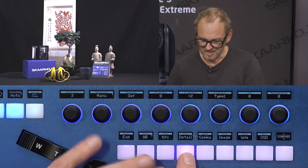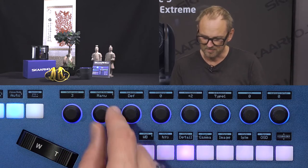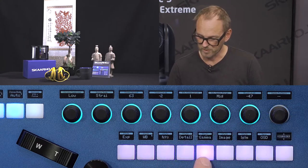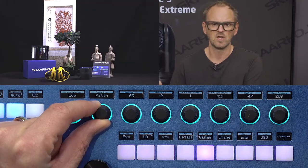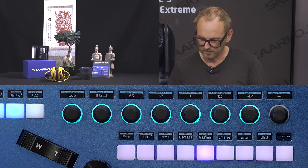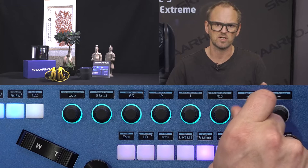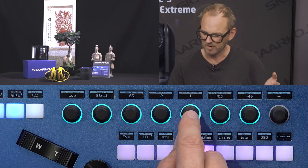In the details menu, there are many sharpness-related settings: the level of detail, the mode of detail in auto and manual, bandwidth options (low, high, medium, default), crispening, and various types of balancing. In the gamma menu, changing the gamma mode has a visible impact on the picture output. There are also offset parameters related to gamma. Additionally, there are parameters related to the black level: black gamma range, black level, and black gamma level.